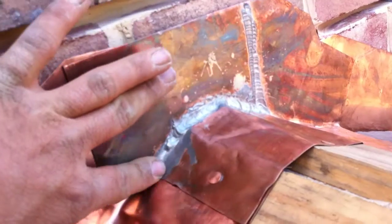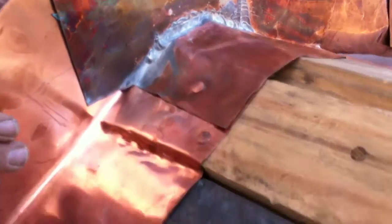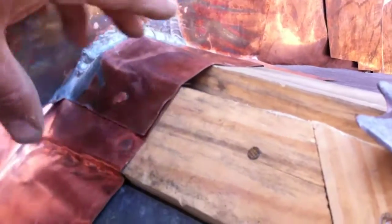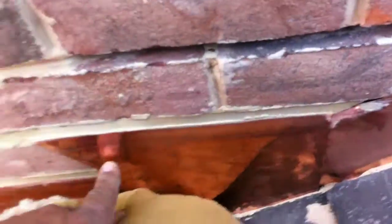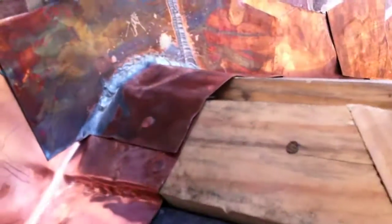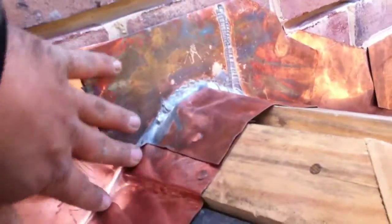What we're talking about here is this little gusset piece that goes around here and caps this. This goes up here and you've got about two inches right there, and that's all you really need to make sure that this head right here is watertight. As this counter flashing gets put into the mortar here, every piece counters the piece above it. Very important. And at the top here, there's going to be one piece that will counter the left and right side.